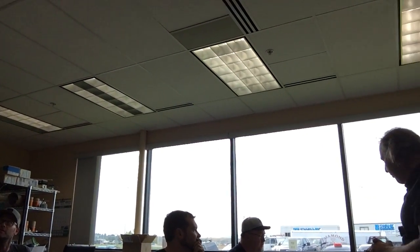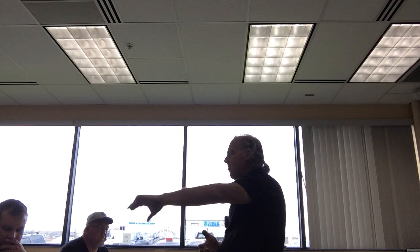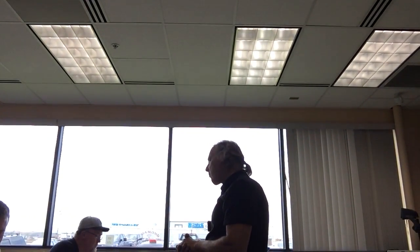I just put 0.016. And that's correct. 0.016 is right on the money. So 16 milliamps, because you move it 3 places. That's 1,000, and you move it 3 places. If you move it back 3 places, it's 0.016. And your 0.015 calculated, so you're right on the money.